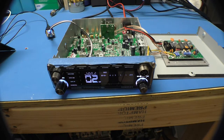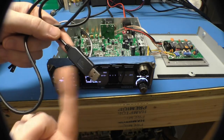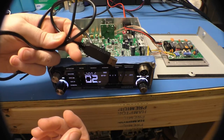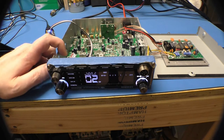You can try three, four, or five times and I would say it fails about 80% of the time. In all seriousness, if I ran one of these cheapo adapters down at 38K baud or 9600, it will actually work virtually 100% of the time, but it takes an eternity. So the simple answer is to just not buy cheap knockoff adapters. I keep them because I use them to cause write failures on purpose — they're very consistent fake knockoffs for testing. People in the field will skimp on it, and if they'll skimp on it, I want to test with it.